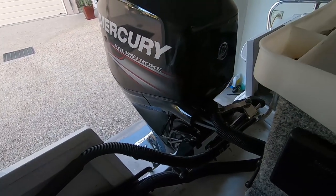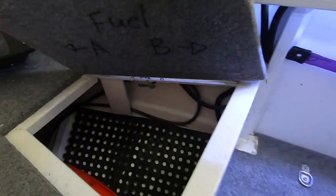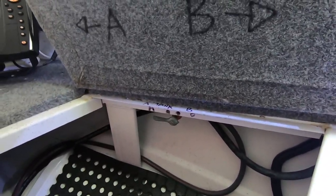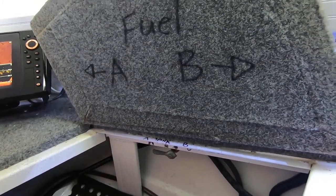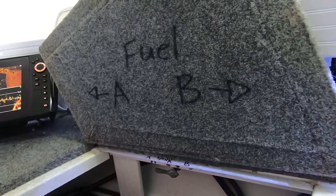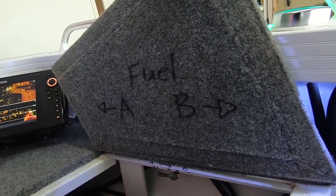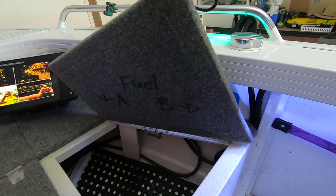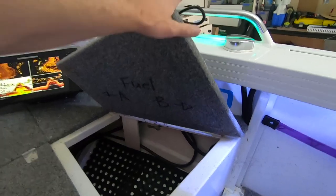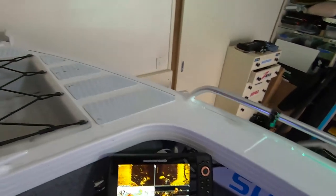It's just a whole other boat with hydraulic steering installed. The other addition is dual tanks under the front, which was shown in previous videos. I've since put a fuel tap in so I can flick between tank A and tank B — I got a bit sick of getting under the front deck every now and again to check fuel and switch over. The next mod will probably be an underfloor tank, but for now I'm happy. I regularly do 180k round trips — Fraser Island and the like — with 50 litres under the front and about 40 stashed elsewhere, no worries at all.